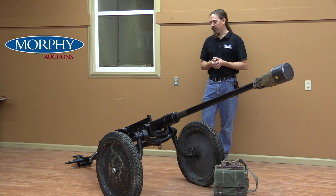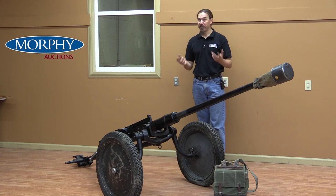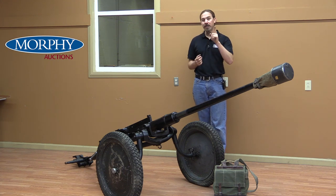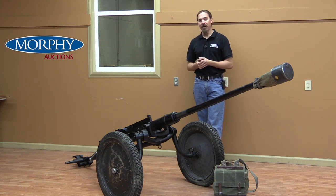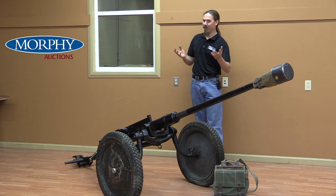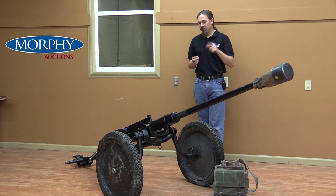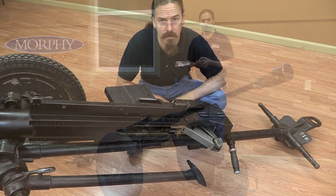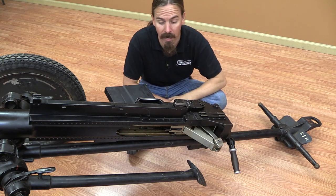The director of the factory was one Adolf Furrer, whose name you will recognise if you've been watching Forgotten Weapons, because we have videos on a bunch of his other stuff. And if you do recognise his name, you already know how this thing works, because Adolf Furrer never met a toggle lock he didn't like. What he designed is a toggle-locked action based on the Swiss LMG-25 light machine gun, except this one is chambered for the 24x139mm cartridge. Here's the actual breech action of this thing — it is a gigantic toggle lock.